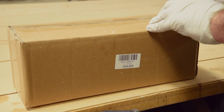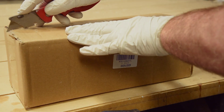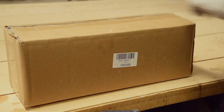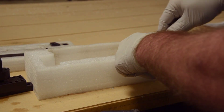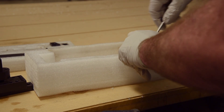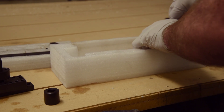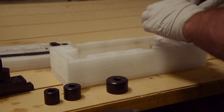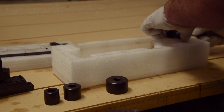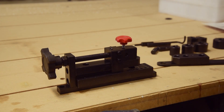It's packed nicely, everything in its place in foam, and with plenty of rust prevention oil on the tool itself. The description on Amazon gives the pin and die dimensions in inches, but they are in fact metric. The pin sizes are 5mm, 6mm, and 13mm, and the four circle dies go from 25mm to 40mm in 5mm increments. It has two holes in the base bar to mount on a bench, or it can just be clamped in a vise, which is how I'm going to use it.